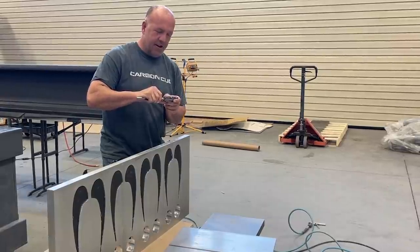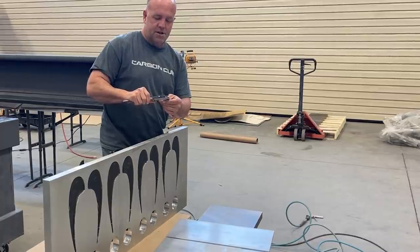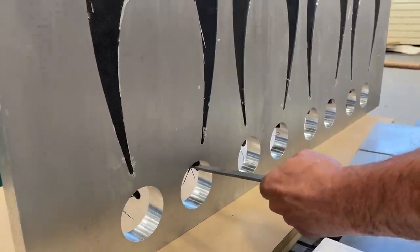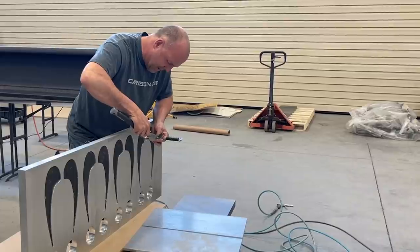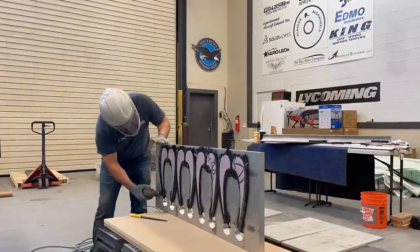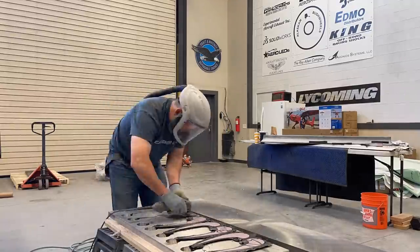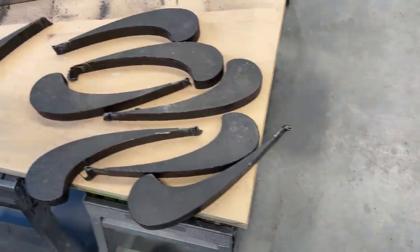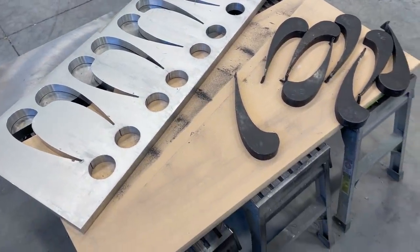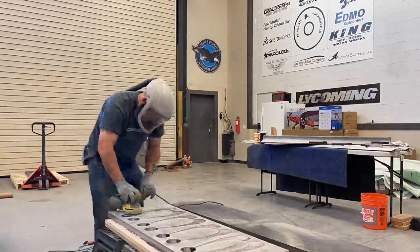So now what I'm gonna do, I've gently tapped these all out the depth I want. I'm gonna just go through and quickly check them with the calipers. Tap them exactly to the depth I want. So once I get it all set, so all the depths are just perfect, I'll just take the multi-tool and just rip the backside off. And that way every one of them is cut perfect to a caliper set depth. And I won't have to do any work trying to tape it and cut a straight line. So I'll cut all these off at once, then pop them the rest of the way out. Back to work.